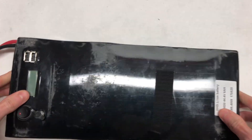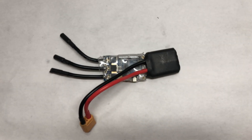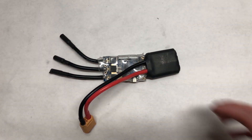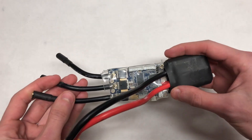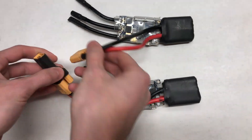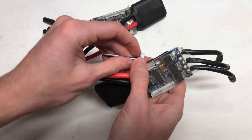It's a great battery because it has a charge port, power switch, LCD screen, and USB ports built in. We're also going to be using DIY Electric Skateboard's Torque ESCs, which are basically just VESCs. We're going to be using two of them because it's a dual hub motor drive. They aren't the best quality VESC you can get, but they'll work for this project. The VESCs are connected in parallel with a parallel connector using XT90s, which we also bought from DIY Electric Skateboard, and then they'll be connected over CAN with a CAN bus connector.